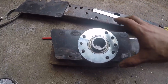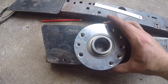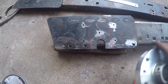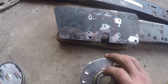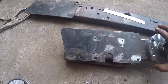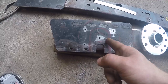Here's the back of the chassis — we've got the reinforcement piece on here which braces it a bit. This is where the bearing mount is going to go. What I need to do is cut a big U-shape there. If I need to take the axle off for any reason, I just slide the axle with the bearing mount straight up from underneath and bolt it into place — otherwise you'd need to slide the whole axle out through a hole. I've transferred the pilot holes across, going to bore them out to ten, ten and a half, bore the yoke out to six, use the hole saw on it, cut the hole, and take the rest of the slot out with the grinder.